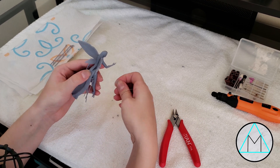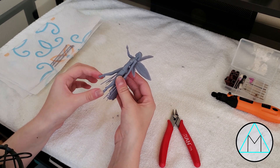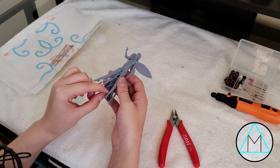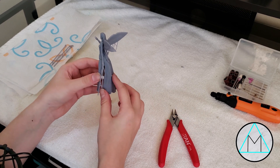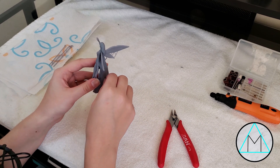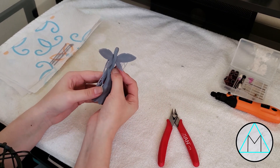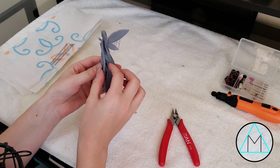A small note on why I supported this the way I do. A lot of people like to take models like this and rotate them 45 degrees back because it decreases the suction force as it goes up — there's a smaller cross-sectional area. I don't necessarily like doing that. I'll risk the suction force because in this case her cape is really smooth and I don't want a bunch of little marks all over it. You can sand them out, but you don't have to. So I have this one nick right here that's not going to be bad to sand out. If I lean her back, I would have a ton of them on there, which I obviously don't want.